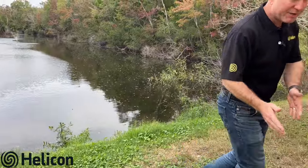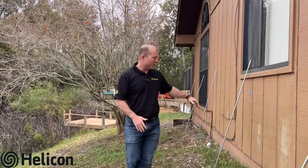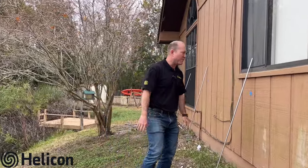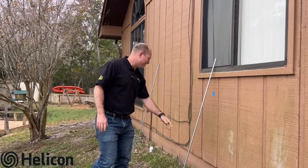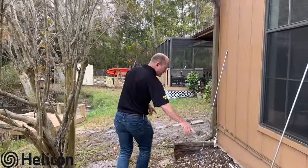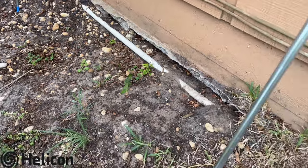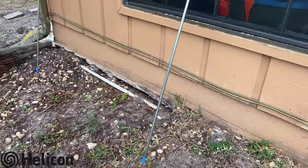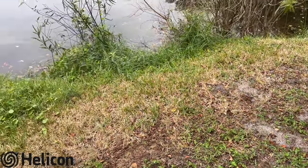It's a very simple process: every five feet apart, five feet down, and they'll put anywhere from about 20 pounds of material at each point, working their way around the foundation and protecting against this erosion. You can also see the sloping downward toward the lake here.